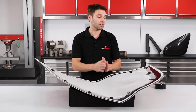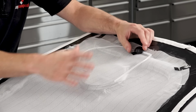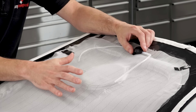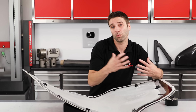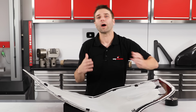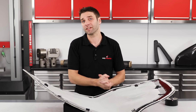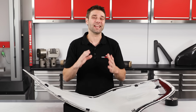You should always aim to keep the spiral and connections on the flange of the mould wherever possible and off the surface of the part itself. Otherwise you will get something called print through, which is a marking effect on the surface of your component. While placing multiple connections and spiral within a part is often necessary on large components, it is really beyond the scope of this beginner's guide.